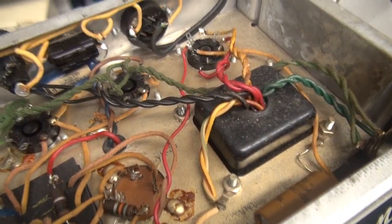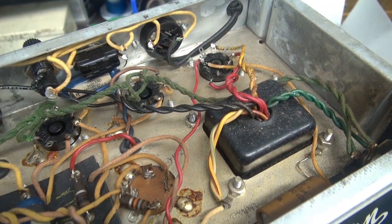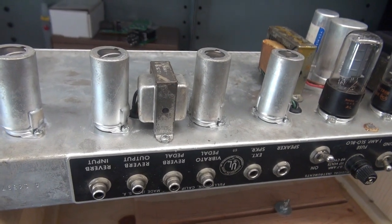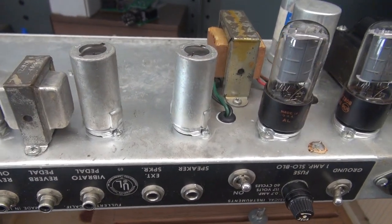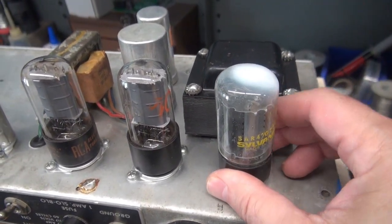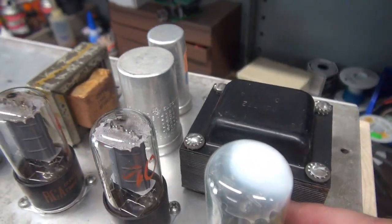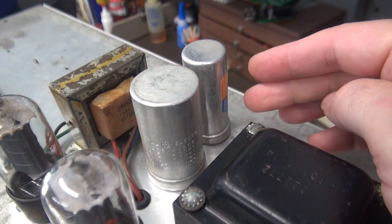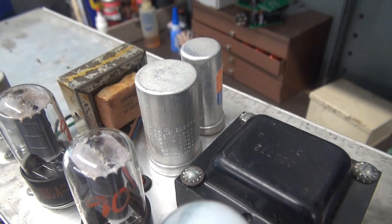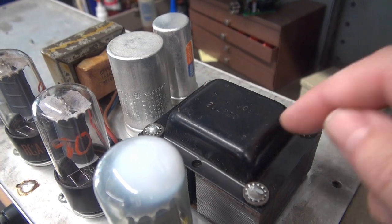There is the original power transformer, and you'll notice that there's a lead pulled — I'm going to show you why. Let's take a look top side. Back side of the amp from this angle doesn't look too bad, but as we come across here you start seeing some issues, like this rectifier tube. She lost some vacuum, so unfortunately that guy's history. Come around here and we see we have two filter caps — this is the original, this is the add-on.